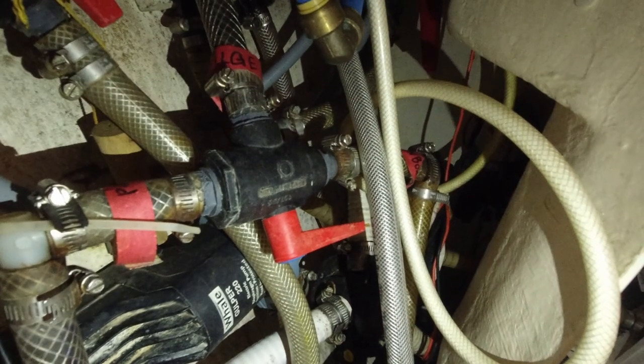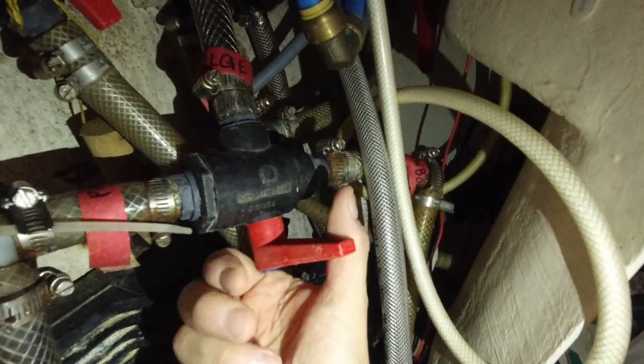I'm going to show you the bilges that were installed. I believe these are factory equipment on the boat, and that's super weird because there's no float switch, no bilge alarm. It was completely manual, and there's no easy way to check to see if there's water in the bilges interior. Now, in defense, in the engine compartments there are automatic bilges that have a float switch, but those are encapsulated - separate compartments from the rest of the boat. So we bought some bilges. Safety is good, right?